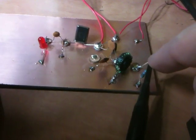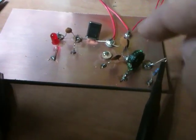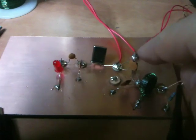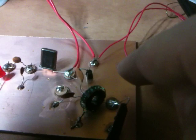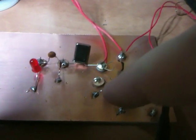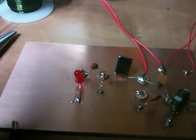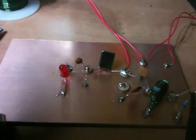Underneath this probe here there's a 50 ohm resistor that's standing in for the antenna, and a coil which basically transfers energy out of the circuit. There's a small 2N3904 transistor hiding back there. Two capacitors form the voltage divider, a crystal, some series capacitance, and this will eventually be the input for a modulation input which I hope to test.